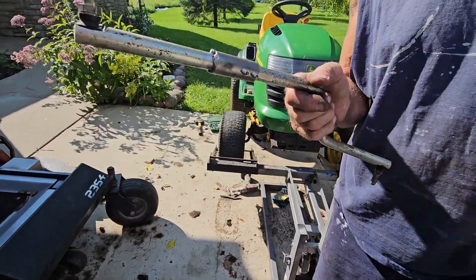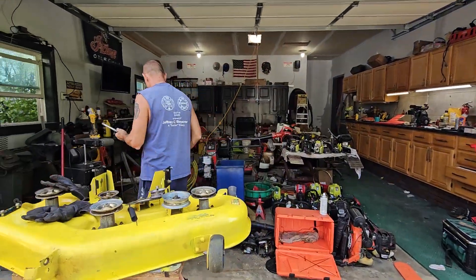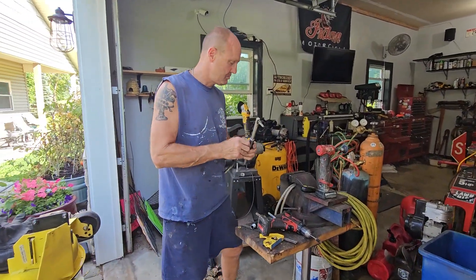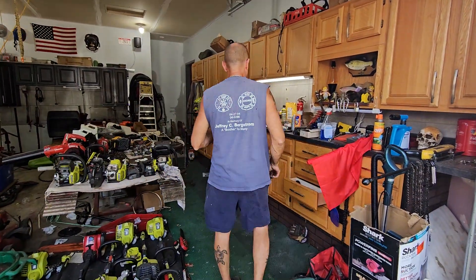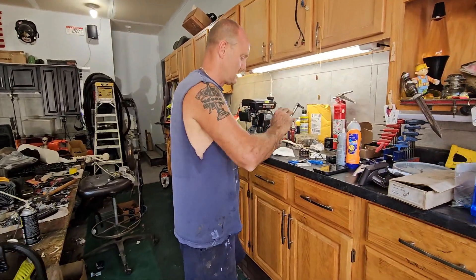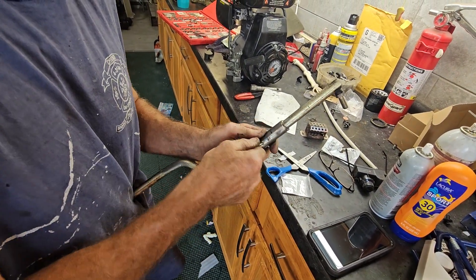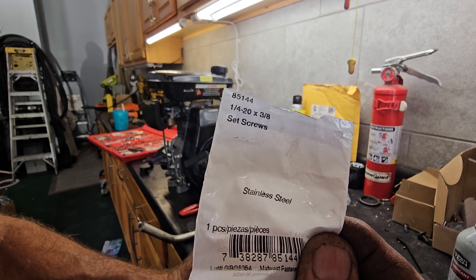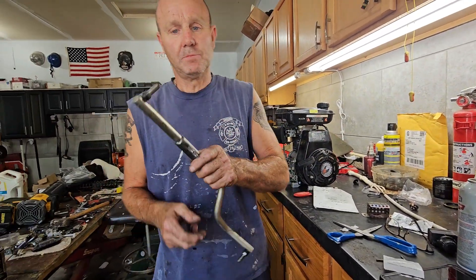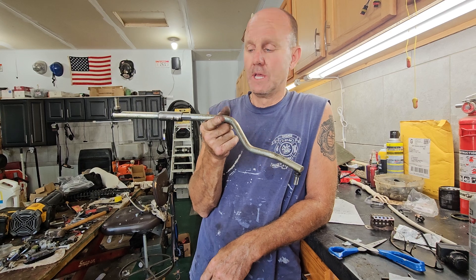It might be cheaper, but some of these OEM parts are very expensive. So we did this on a budget and just wanted to try it and see if it worked. As I put this on with my set screws and Allen wrench — the set screw size I used is stainless steel, 1/4 inch by 20 by 3/8. Set your set screws with Loctite. Now you have an adjustable tie rod end, but you won't have to adjust it because your wheels are on center with no toe-out or toe-in — this should work perfectly.